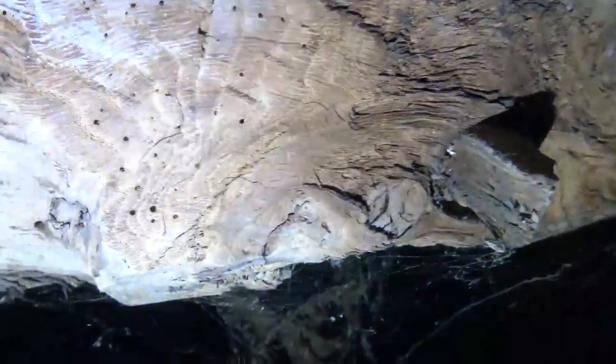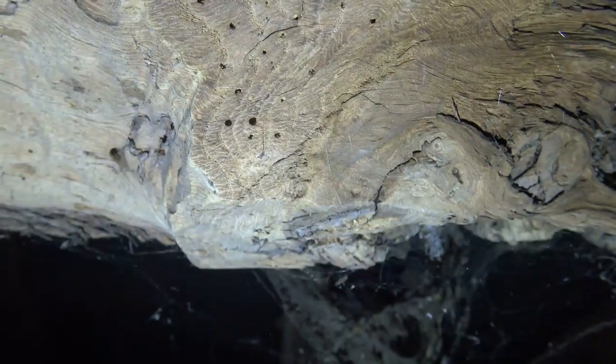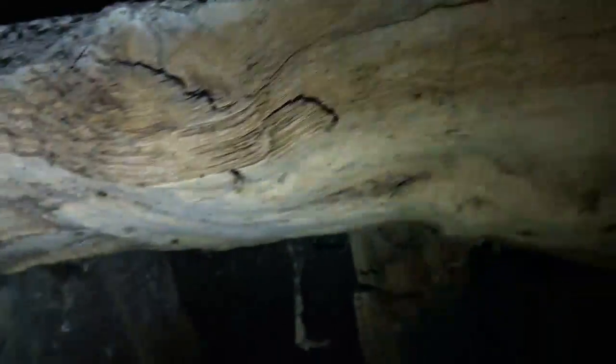So there you go — these are oak, and you can see this piece of timber here is oak. That's the heartwood, and then this is where the soft white sapwood is, and you can see it trails off there because they've cut out of the sapwood at that point. The sapwood's a bit thick on that little section — you can see it where it's white and that's been eaten away by beetle — but the actual middle of the timber is fine, there's nothing wrong with it. And there's another piece of elm here, and again very typical — you can see the much finer grain of the elm, and right in the middle of the timber there are beetle holes all the way through.